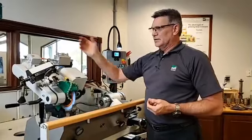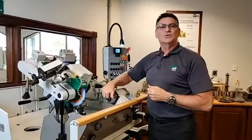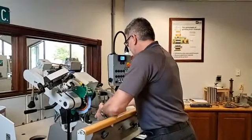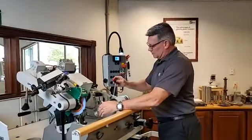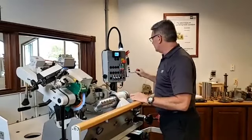This same receiver is on the optic control measuring stands, so we need to do our due diligence daily on that to make sure we're keeping it clean as well. Because we could be clean in here, but it's giving us a false reading off the stand. And we should always feel a very nice, slow, gentle lock as that's coming into place.